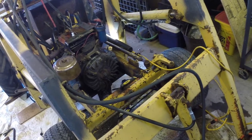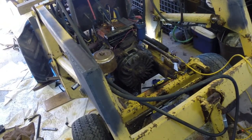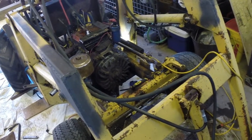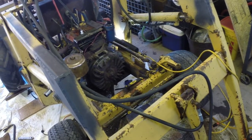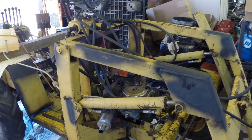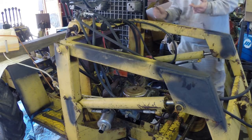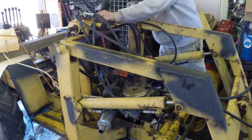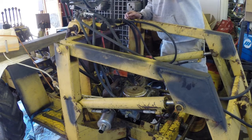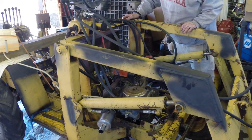I haven't tested the hydraulics out yet so I'm not real sure about them. I've changed the filter on the hydraulic pump and put new oil in it, but I forgot to change the sump screen, so I'll go back and redo that. I'm going to hook everything up and see if I can get it to run. The way this whole build's been going, I really expect the worst every time I try something new — but here we go.